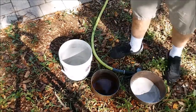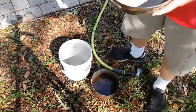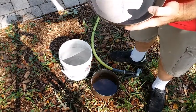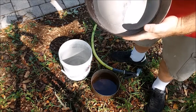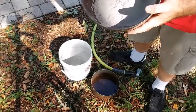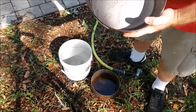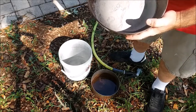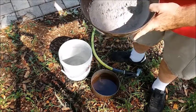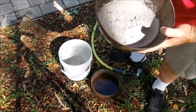We're at the stage now where I need to separate the ash from this stuff. These are plastic integrated circuit chips — believe it or not, they started out as plastic integrated circuit chips. I soaked them in an AP solution for a couple of weeks to dissolve all the legs off, then they went through my foundry and got oxidized, then through a blender into a powder, and I sieved out all the big chunks of base metal. What we're left with is this nice fluffy white powder that has some bits of metal, a lot of silicon die gravel, and gold bond wires from the IC chips.